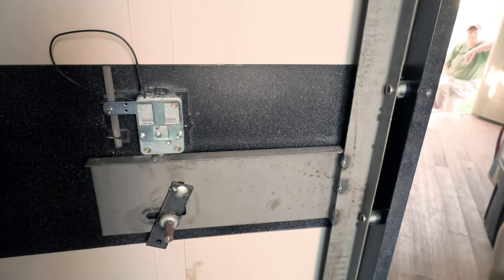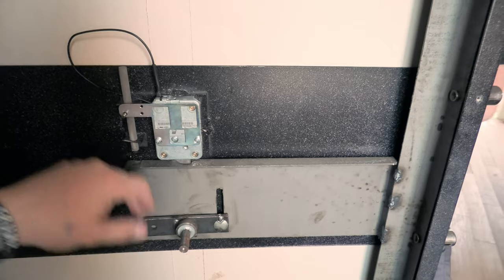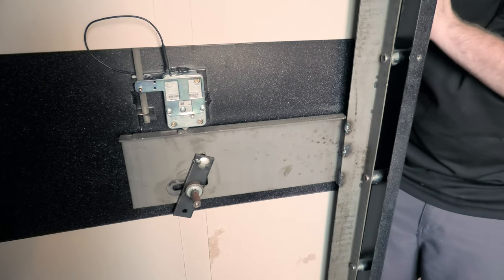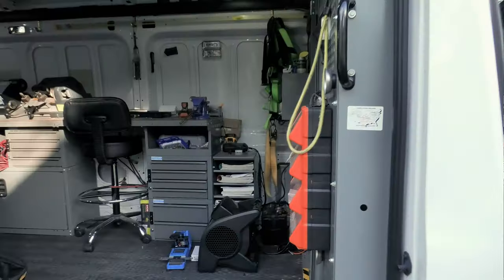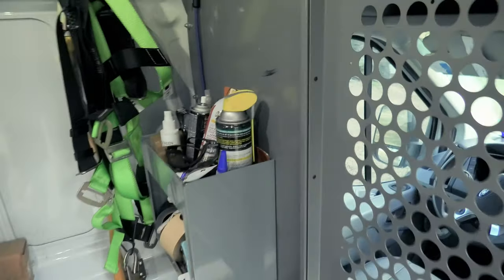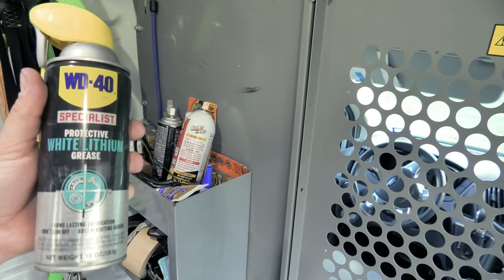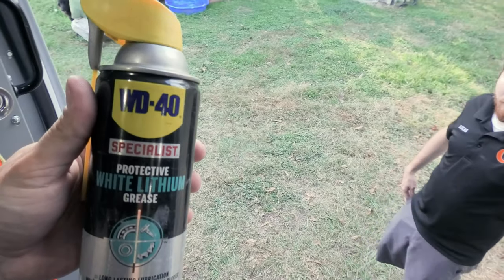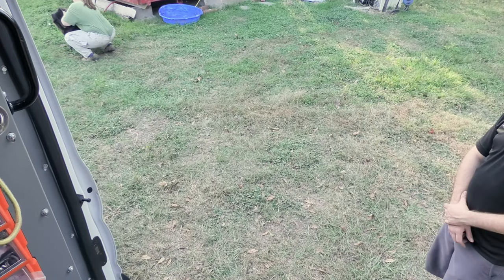The railing stuff's a little stiff. Lock it back into place, try it one more time. I need some lithium grease or something in here. We'll go ahead and put some lithium grease and I'll recommend servicing this while we're at it. This is our WD-40 Specialist Protective White Lithium Grease — this is what we use on safes and safe parts. You don't want to use any other stuff; this is the industry standard for servicing safes.